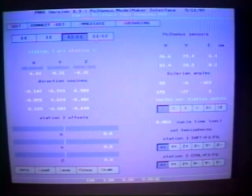Custom software written in Pascal by David Holden and Richard Monkhouse of CosTronics Electronics in London combines two localization receivers into a single coordinate system and ships the combined localization values out to the Model Maker software via an RS-232 serial port, just as if a single localizer was being used.